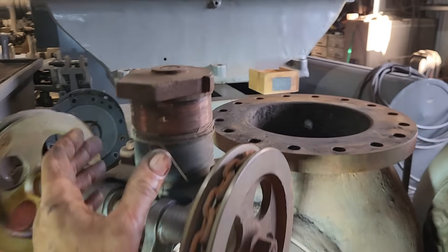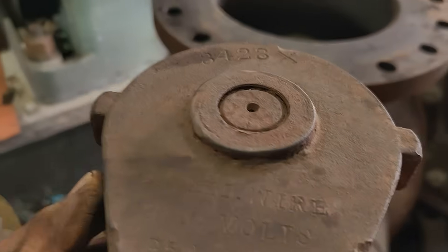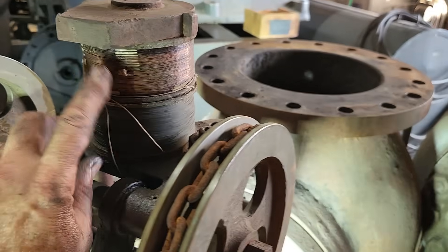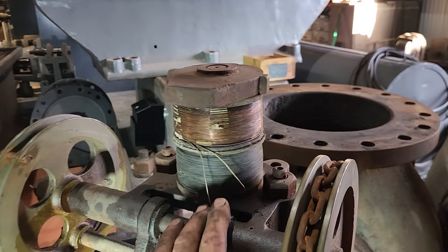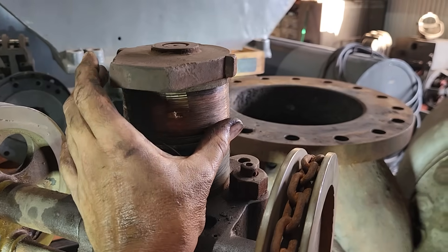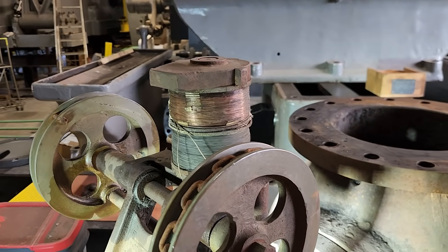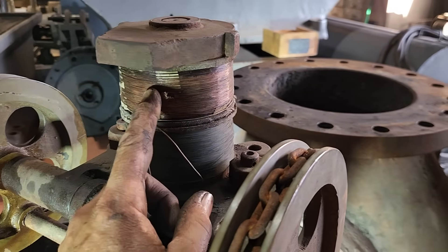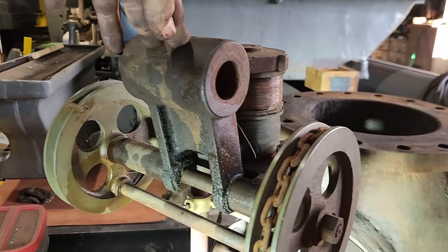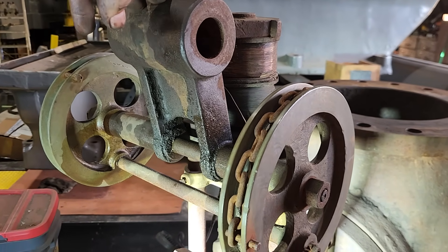This is how this thing works. You have an electromagnet up here and it says right on it 260 volts, 950 ohms — that's very useful for rewinding that. When the engine is in operating condition, you would have 250 volt DC in a circuit that would run through a bunch of disconnect switches, emergency stop buttons, an overspeed fly ball device, and then over to this coil. The coil would be energized and then this weight would be up against it. As long as that electricity is flowing and it's not overspeeding and no one is hitting the emergency stop button, this weight stays up here.